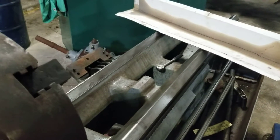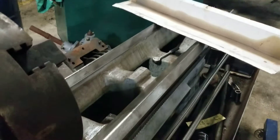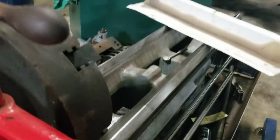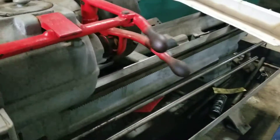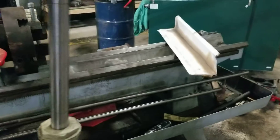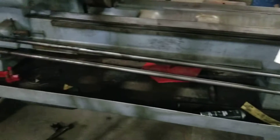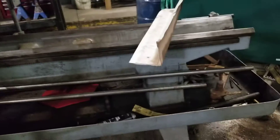This lathe's got quite a bit of wear in it. The ways were pretty rusty and I spent some time with 600 grit sandpaper polishing them up, cleaning them, oiling them down, getting all the gunk off — paint, that sort of stuff. Same with these drive shafts. They had some nasty rust on them, as you can still see over here. We polished them up and got some penetrating oil on there.